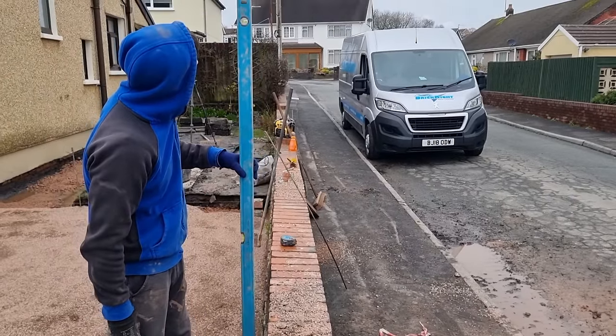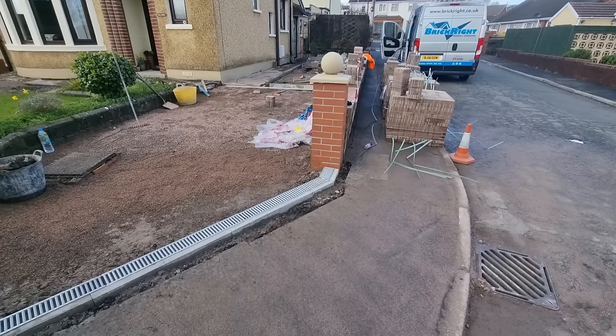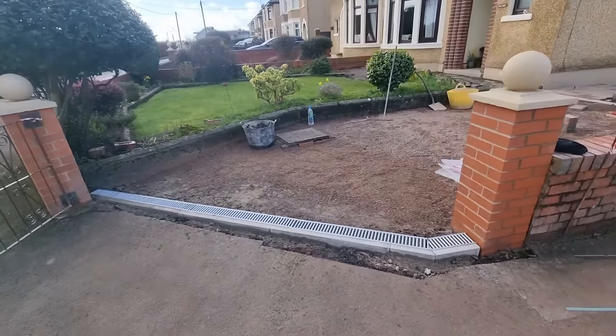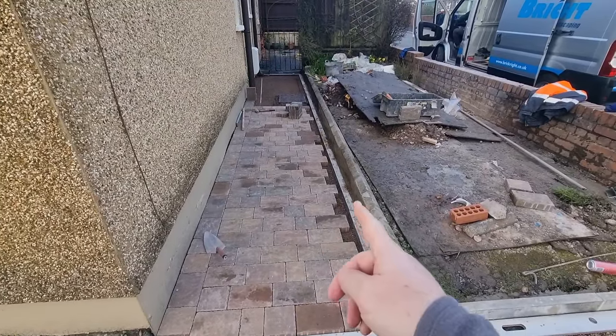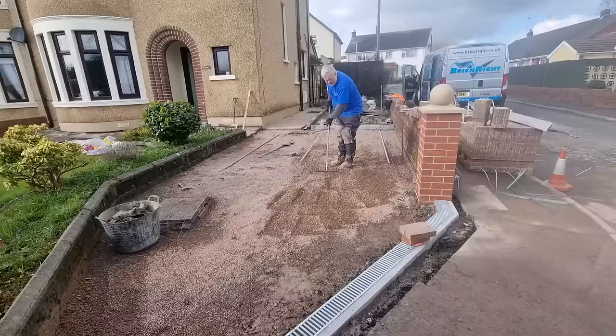Fraser's just showing you how bad that wall is — it was about 80mm out of plumb. There's the pillar with new concrete fitted, and obviously new brickwork with the pillar placed back on top. We also had to put drainage down on the right-hand side just to get rid of the water so it angles away from the house.